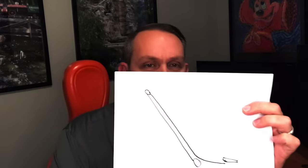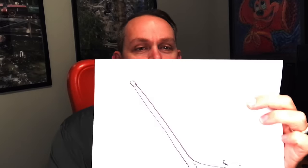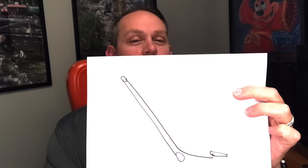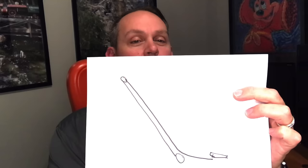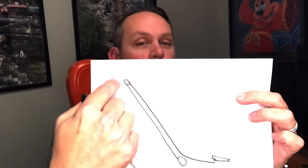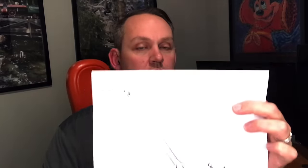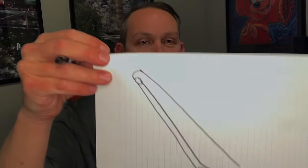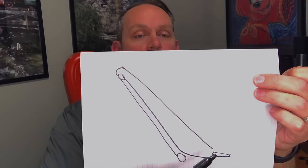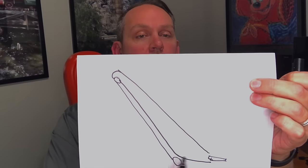All right. We'll get our paper out where you can see that, hopefully. Okay, so here's a lift, basically. Here is our drum down here, where the cable is spooled up around it, and the cable goes all the way up and over the sheave at the top. There's a catch wagon at the bottom. Now, we can't connect that top sheave straight to the bottom, because you're not trying to pull the train this way. You have to pull the train this way first.